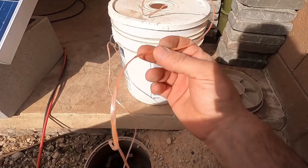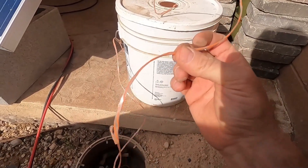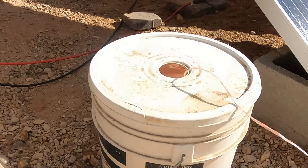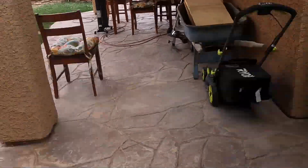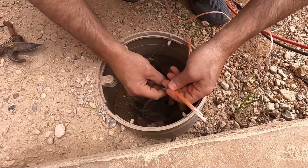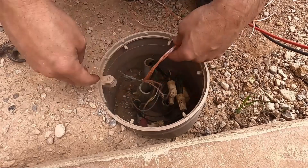Since the 8 gauge PV wire is pretty heavy, we're going to be running two nylon strings through the conduit. The old pull string has been in the conduit for over 10 years — I do not want to risk it breaking. I get one chance at this.